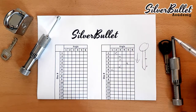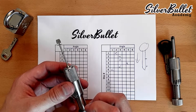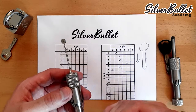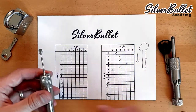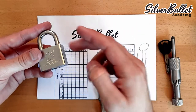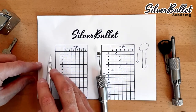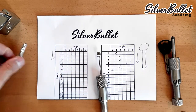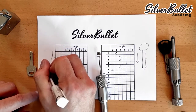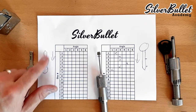This is important to keep track of, because it really depends which way you put the tool. In the back tensioning configuration, I tension at the back and pick all the disks before the latest disk. Disk number 1 will actually be the disk all the way to the back — or just before it, since the very last disk is used for tension. So I pick it in that direction, but the key is oriented differently in the lock. Again, it's good practice to draw a quick key so you know which way you decoded your lock.